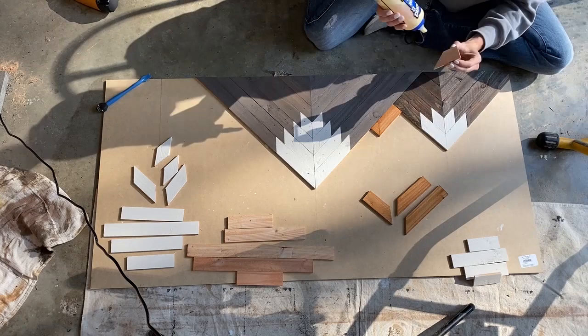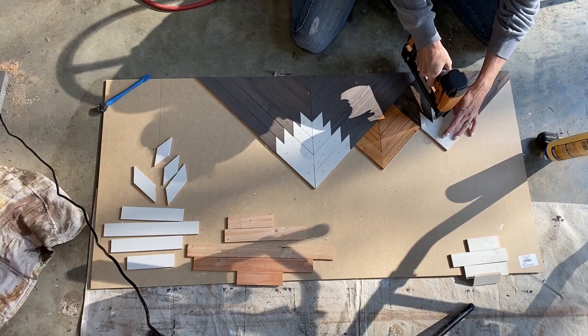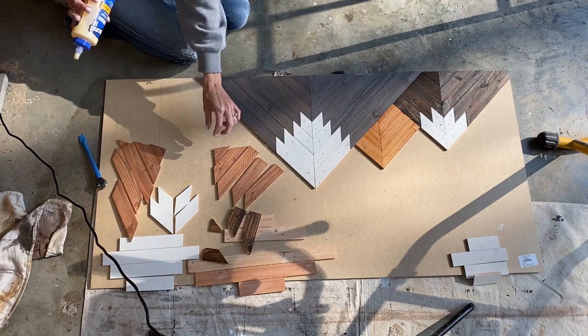I also like to always end with a gloss at the end. So you're going to want to cover it with some sort of a gloss or a polyurethane or something like that. In the beginning, I did not do it. I even tried using a wax one time, and it just didn't repel the dust like I had hoped, and the sign just appeared dirty.